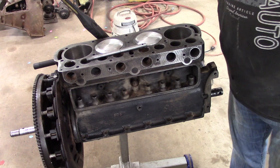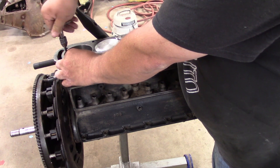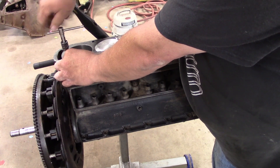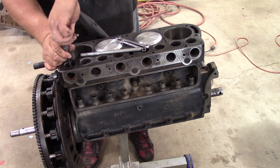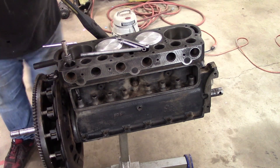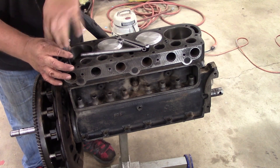Let's run this down the hole — wrong end. Those are the wrenches to adjust it. So let's start it down in. Very little resistance, just enough that it's cleaning. Nice and slow, only turning clockwise. We're going to put this down until it goes through. Now when you pull these out, you continue to turn clockwise.